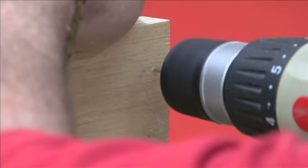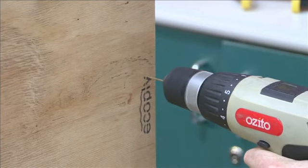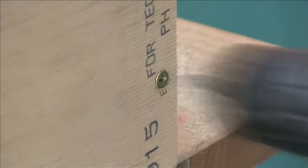One of the tips on gluing and screwing is make sure that you've got a good guide hole but not too big — about the normal eighth of an inch is just perfect. Then you drill that first, your screw will go in, your wood won't split.